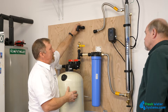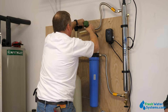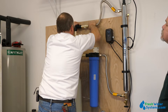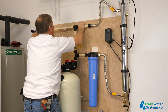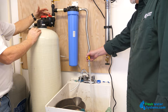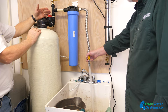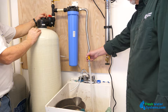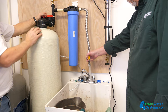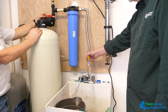The rest of the connections are made using John Guest ProLock series connections and CPVC tubing, and we also added some pipe clips to really make the job look nice and straight. The next step is we're going to flush the calcite filter — that calcite media has a lot of fine dust on it. We've disconnected the flex line from the UV light and slowly cracked the bypass valve open so we can get flow going through it. We'll flush this until the water is clear. We took the filter out of the cartridge housing and we'll add the chlorine bleach afterwards.